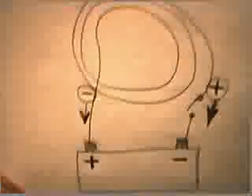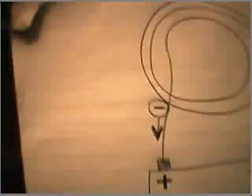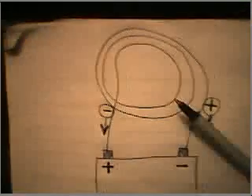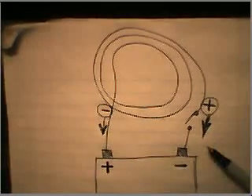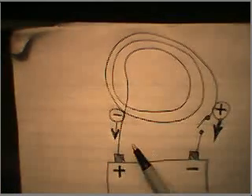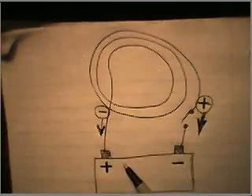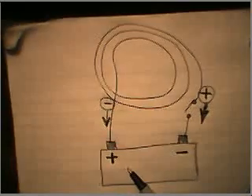I drew a little picture here and I'm going to hold this up — I hope this works. This is your battery right here. I hope my microphone is picking this up. What a lot of people don't realize is: if you put power into this coil here from this battery when you close the switch, the minute you open the switch you'll have a reverse polarity coming back out of your coil. So if I put a positive in going into the coil, the minute I disconnect it, negative comes back out — it immediately discharges from the coil. The coil is almost like a capacitor; it discharges and goes back into the battery.